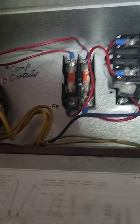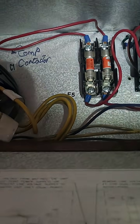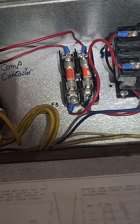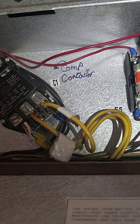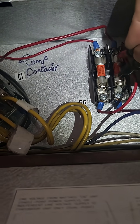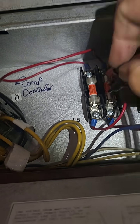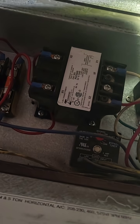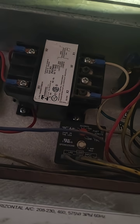Alright, Skymark AC. So I had blown fuses — these are 0.2 amp fuses that protect the transformer. That's a 600 to 24 volt transformer. Let's just test these now. So that's my meter. I use a bit of tape to work on. Yeah, so that protects — if something is grounded, that will protect the transformer.